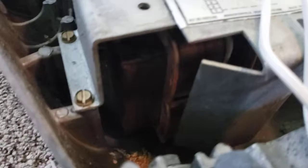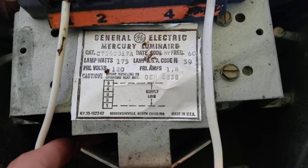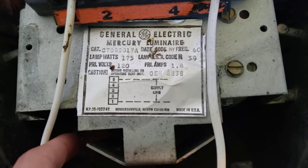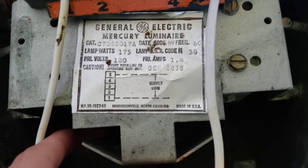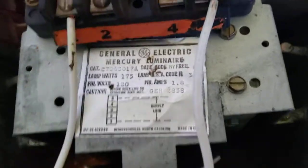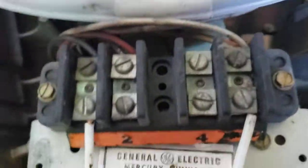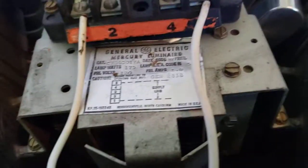Next here is the big ballast — a big foot four coil ballast — and it's heavy, probably about the size of a 250 watt ballast made today. It's pretty high quality though it is loud. Next is the tag, which is a nice foil tag as GE did — all the information is perfectly there. This fixture was made in January 1964, which is what the date code NY translates to. We also have a terminal block with numbers that correspond to a wiring diagram, which is nice because it shows you exactly how to wire it up even if you don't know what you're doing.